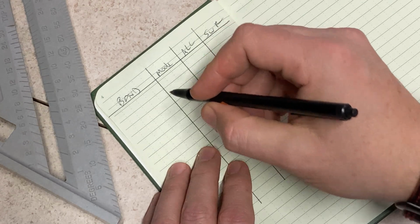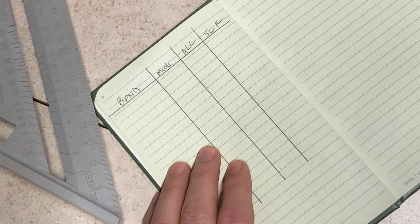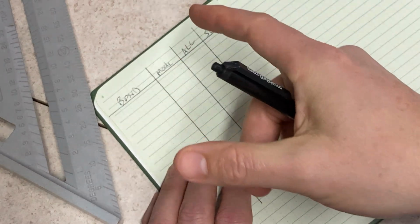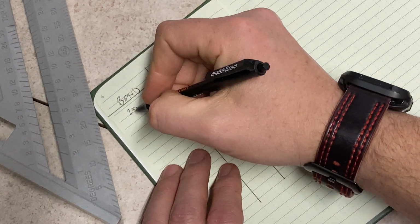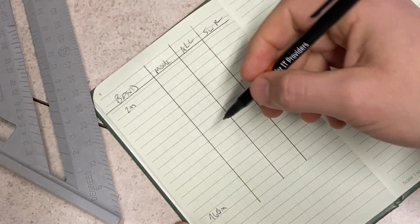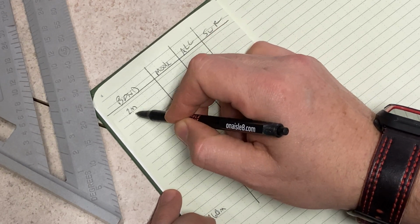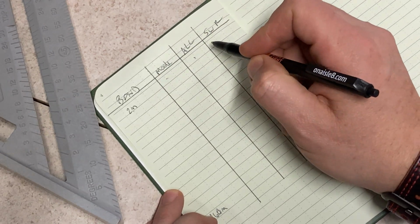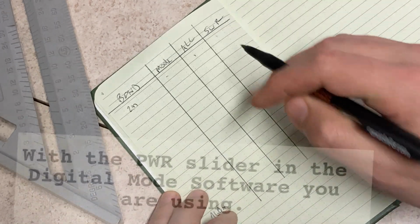And if I don't change that mode, even though it may be an upper sideband, and JTDX is receiving the signal, it won't transmit. It gets 0 audio. So I'll go and make this chart here all the way down to 160 meters. And what I'll do is verify that the radio on that band has the right mode, the ALC is set at the correct level, and the SWR is matching up, so I have a tune. And if I have a tune, I note it, right?